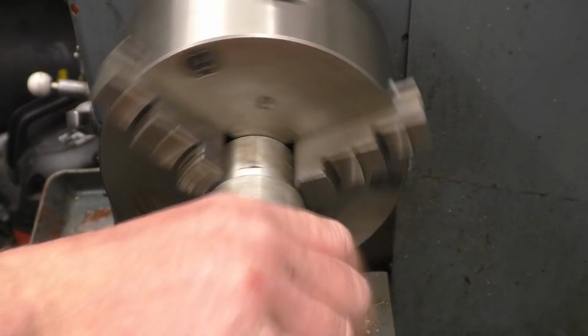This is the actual thread repair kit. You've got the drill, tap, insertion tool, and then the little helicoil tang break-off tool there for snapping the little tang off at the end. The next thing to do is to put the special helicoil tap in. A little bit of WD-40 type of lubricant is ideal for aluminium.